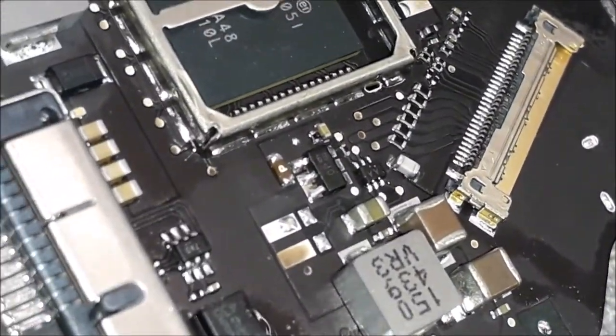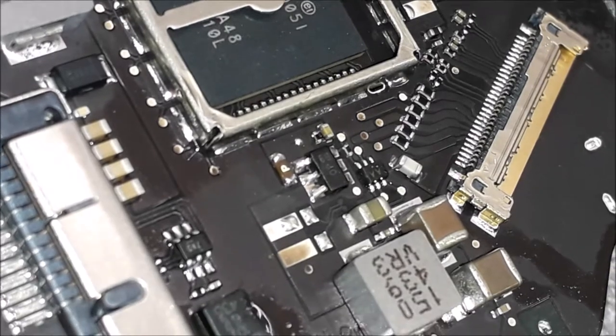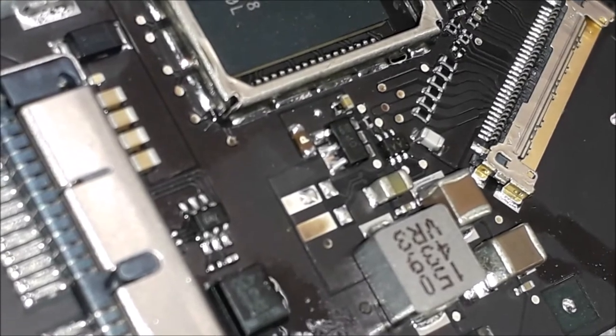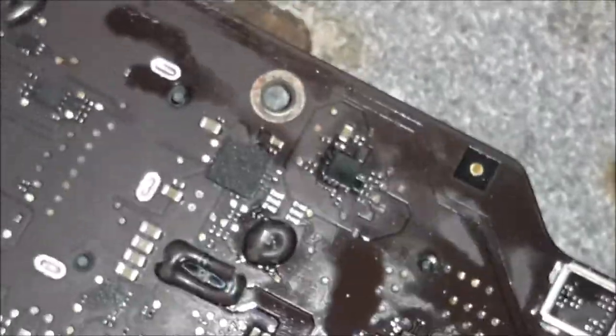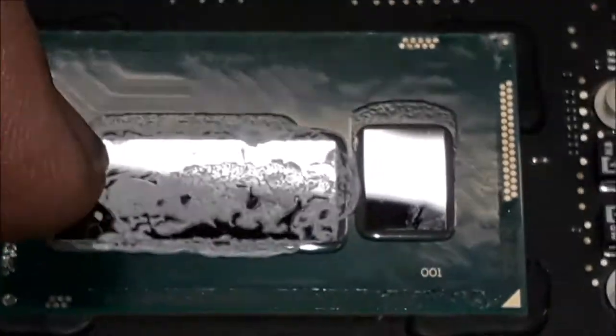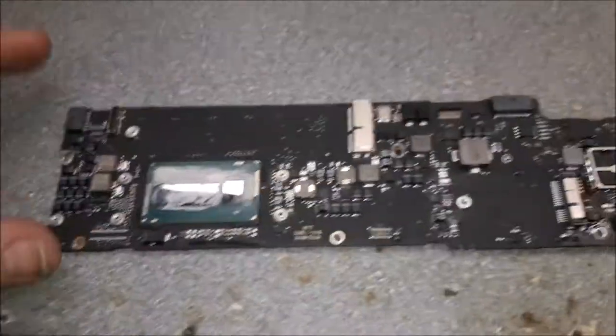All right guys, you can see over there, we made a big, strong solder on the pins. You can see on the other side the varnish of the board is lost, and how much corrosion there is. Now this board is going into the ultrasonic. I also reworked around the LED driver, look now. That's the flux on the board. Now we're going to put it in the ultrasonic and remove everything. Remember to clean the CPU before putting it inside the ultrasonic. And now, this board is going to be beautiful.